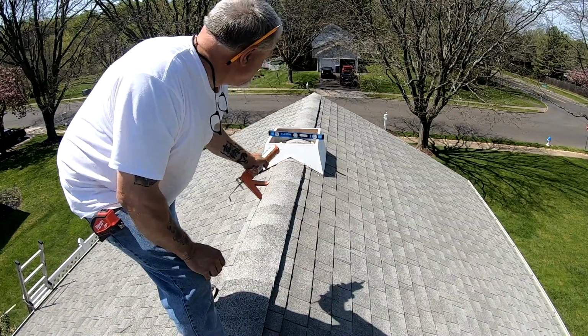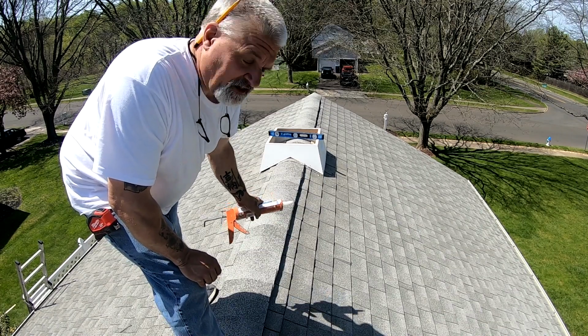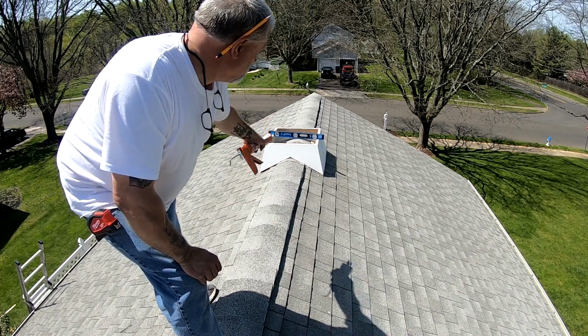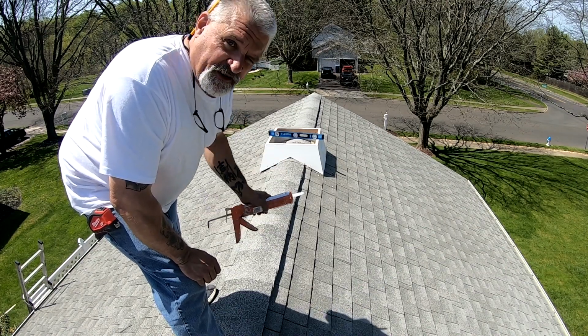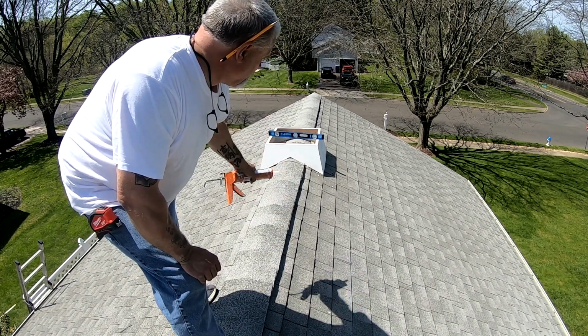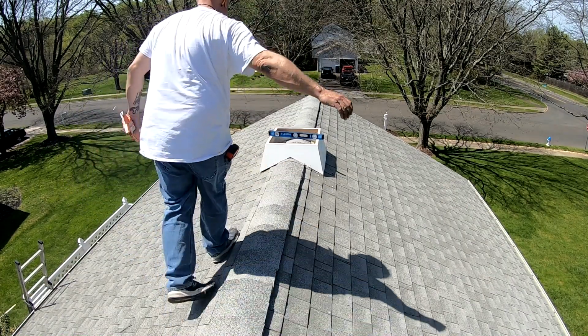After you get this on nice and solid like it is right now, silicone the hell out of the inside of it. But just where the ridge is, not below it. You go around the 2x4s that are in there holding it to the roof, and go around the top of the ridge. But don't do the bottom, because if water gets in, you want it to get out.